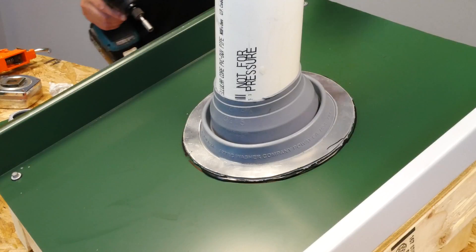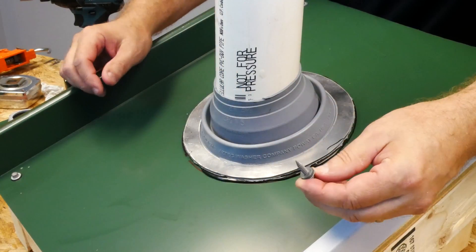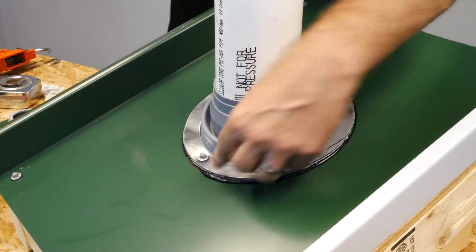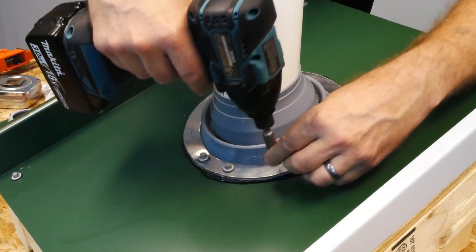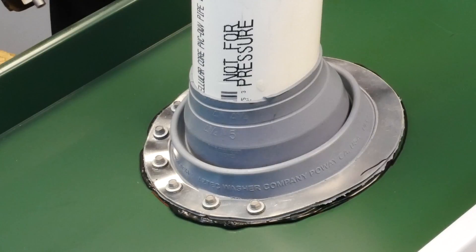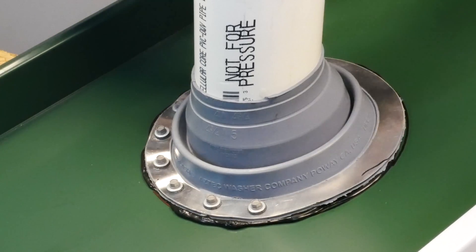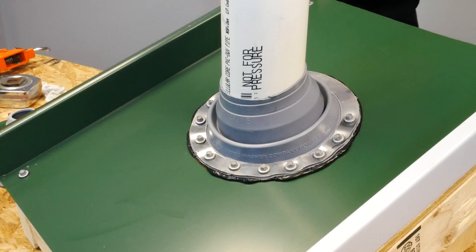The rule of thumb with screws is they need to be approximately one inch apart all the way around the perimeter. This is simply a hex driver screw with an EPDM rubber washer to help seal. We're going to start right down in the middle of the flange. Don't worry about caulking squeezing out — we'll clean that up in a minute. You want to use a screw appropriate for the substrate underneath. We're on top of a wood deck here, so we're using a screw with a sharp point — this is called an A-B point, which is designed for running into wood. The screws don't have to be perfectly an inch on center, but something close to that works best.